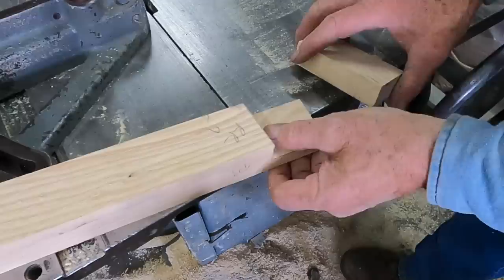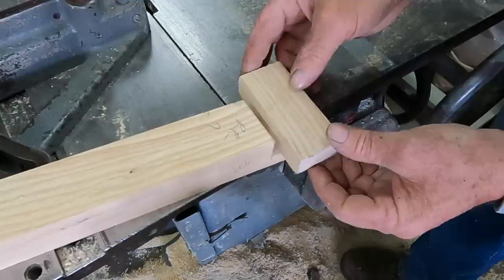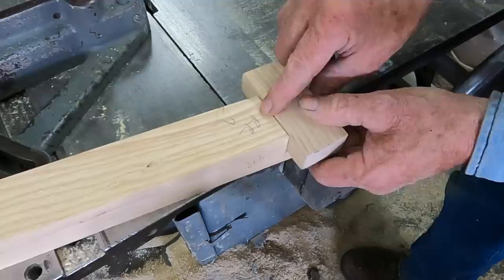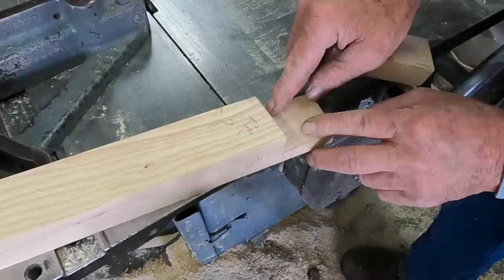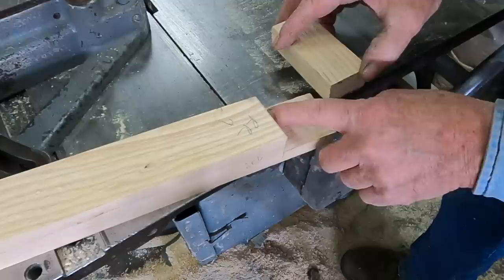See, these are my end joints for the front and rear bow. And this is the same material I cut off the ends of those bows. And I'm a little strong here, which I really wanted to be. So I'm a little extra thick here. These rear bows are at 7 degrees and the front bows are at 5 degrees. So I can put this on the table saw and bring this down to where we end up being flush here.